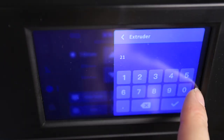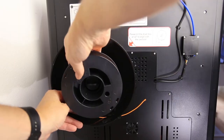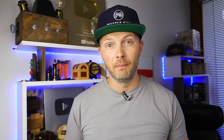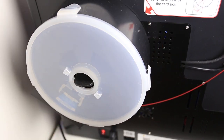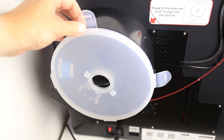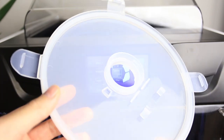Before removing the filament, you have to go to the load menu, preheat the printing head, and then hit the unload button. Now you can pull out the rest of the filament and put a new one in. But here's another issue with the dry box: if you use a small spool there are no problems, but if you put a spool with one kilo of filament, the spool gets jammed after you lock the dry box. It's even difficult to pull out the filament by hand, which leads to underextrusion. The quick solution I found was to unlock two or four locks so the spool moves freely. The other option is to sand down the middle part of the lid so it doesn't push as much on the spool.